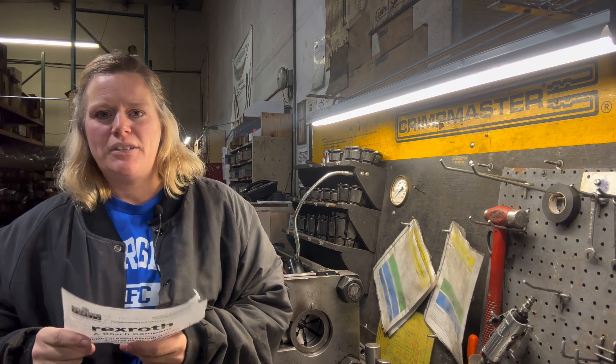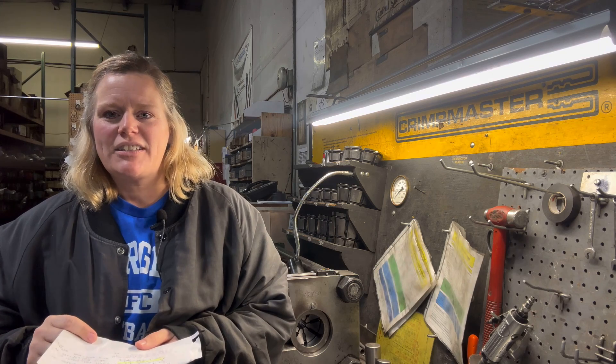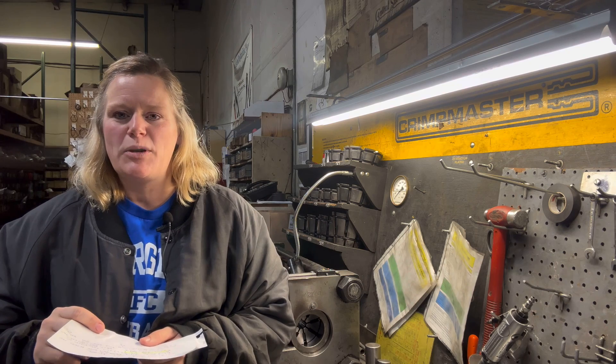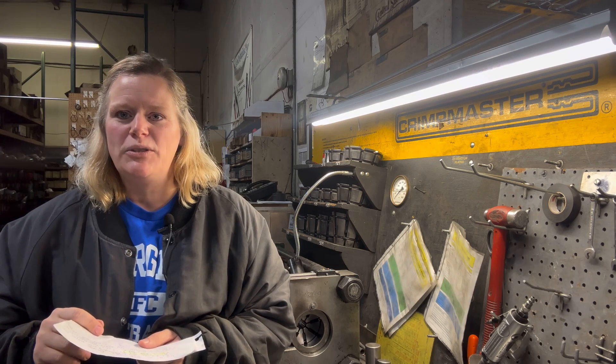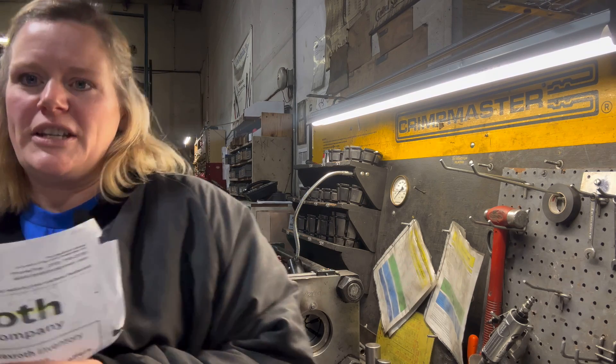In this video I'm going to be showing the process of building a new hydraulic hose. In a hydraulics shop situation, usually there's an existing old hose being reproduced. In this case I'm creating new hoses for a joystick kit. I have the information for building the hose written on a piece of paper - the type, diameter, length, and the size and style of the fittings on both ends.